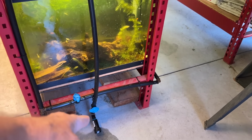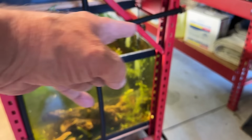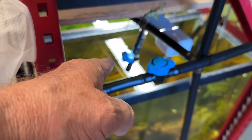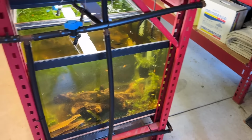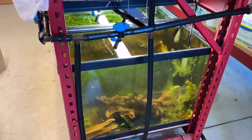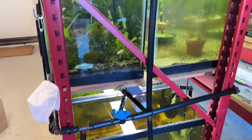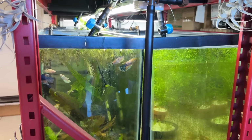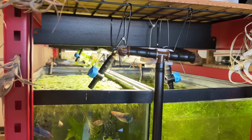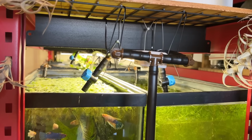And the garden hose goes in, that valve opens right there, and we can do the bottom. If we're doing the bottom on this side, then we open these valves one at a time, let the water cycle. And I think low enough pressure, I can do all 5 at a time. I'm going to have to get the pressure right because as we saw, I had the pressure quite low and I was only getting water out of 3 of the 4 valves up top there. So a little higher pressure or just do a couple at a time, probably less chance for a mistake.